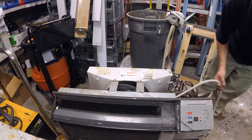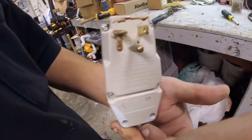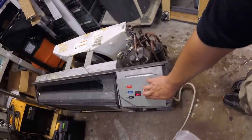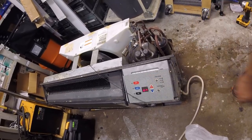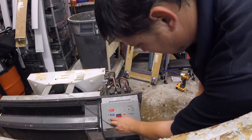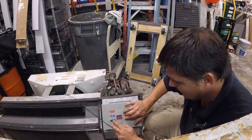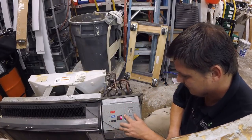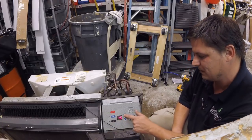So let's turn this unit on. I'm gonna turn it on manual. I am still lucky enough to have a 208 volt outlet right here. Now that's full of water. That's gonna be nice when I plug it in. It's gonna show us on here in a second. Here we go. But we don't want on. It's not gonna come on. Hold on. Y'all remember the menus? Alright, here we go. Oh, it's double off, ain't it? Hold down up arrow. Double click off. Hit heat. Use the arrows till you go to zero. Click off again. Now you're in manual controls.